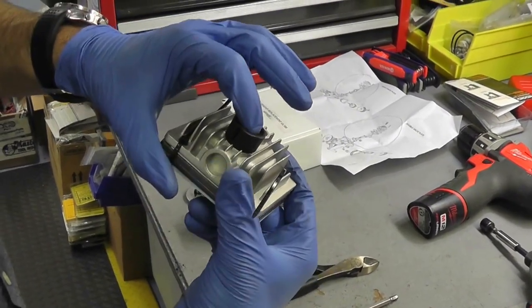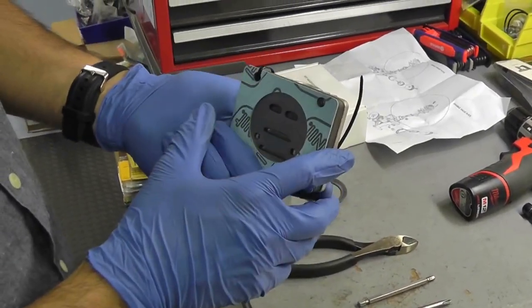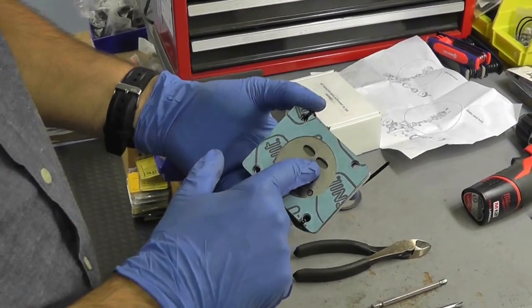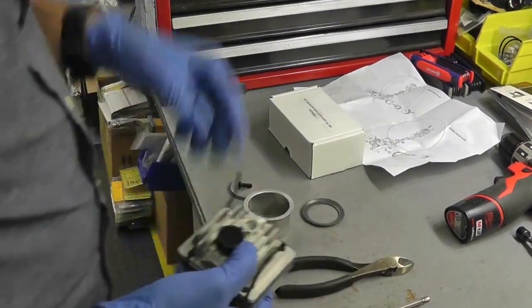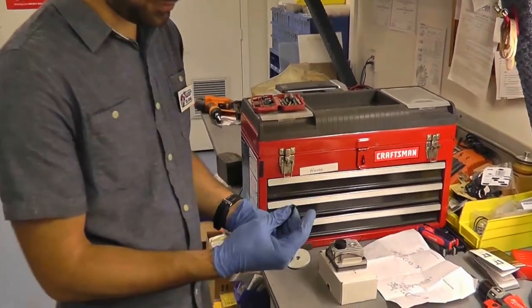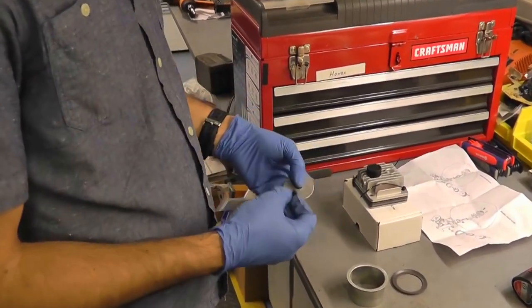The little air intake filter denotes the intake side of the head, and the intake side matches up with the two small holes on the valve plate — that's how you know it's the intake side. The kit also includes a new piston top and a piston screw, so use all the parts in the kit.